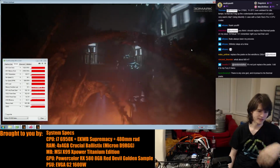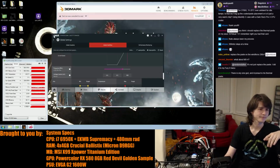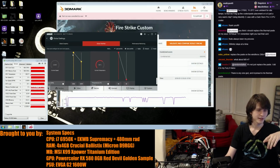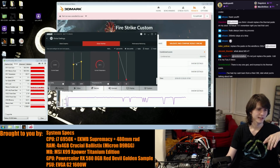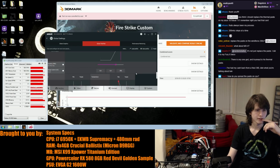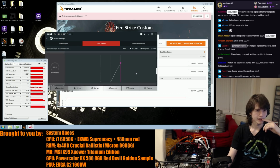So I'm going to call this stable. Also, I'm going to drop the fan speed back down, because 3,000 RPM is not okay with me. We're going to go for 2,200. I guess I'm going to aim for a 50C target, and...